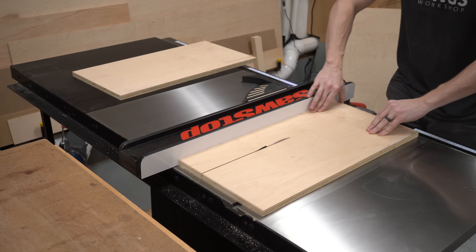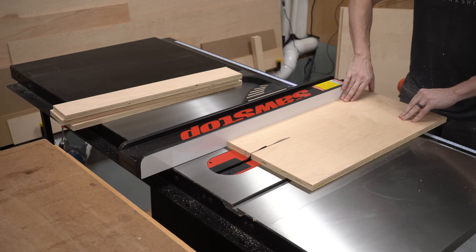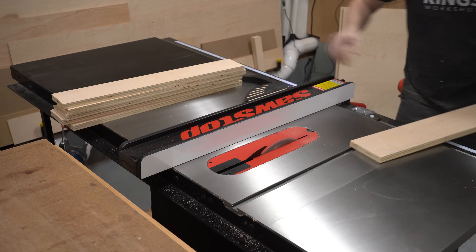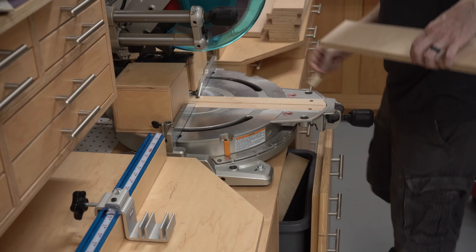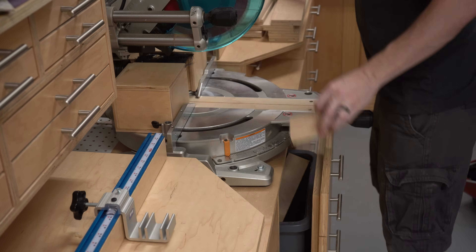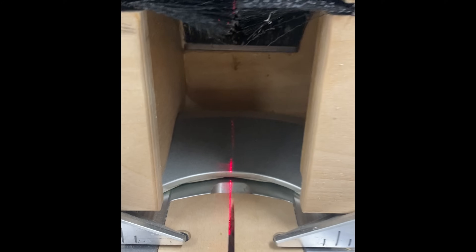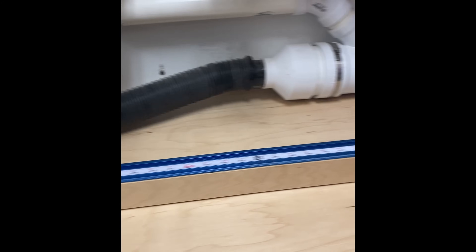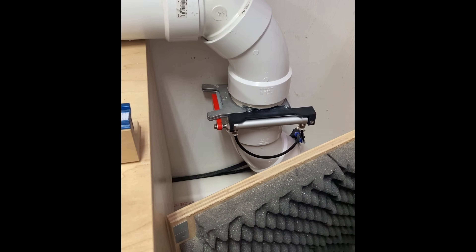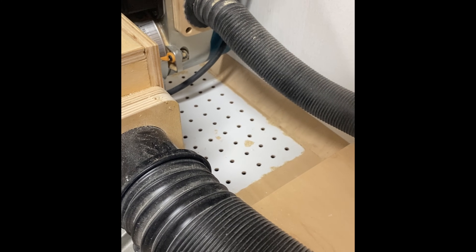The miter saw is the one tool that needs to be monitored a little bit differently than the rest. Almost every other tool in the shop doesn't power down between each use — if you're executing the same step on 20 pieces of wood on a table saw, router table, drill press, bandsaw, planer, or joiner, you would power on the tool, complete each task 20 times, and then turn off the tool. On a miter saw, when you release the trigger between each cut, it powers down the saw each time. We don't want the system turning on and off every time between cuts. So for the miter saw, once the trigger is released, it starts a 15-second timer versus starting the 3-second spin-down like most tools would. If we start another cut within that time, it clears the timer and starts it again once the saw powers down. If we don't start another cut within 15 seconds, it opens the blast gate behind where my downdraft is behind the miter saw, and then closes the main miter saw gate. It leaves this open for 5 seconds to clear any remaining dust that may have gotten behind the saw, and then goes through the normal process. This is the kind of thing you wouldn't be able to do with a store-bought automation system — they just don't allow for that amount of customization.